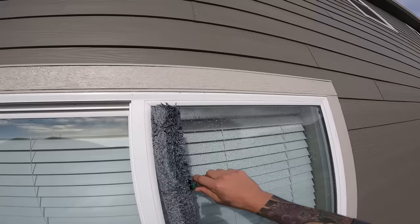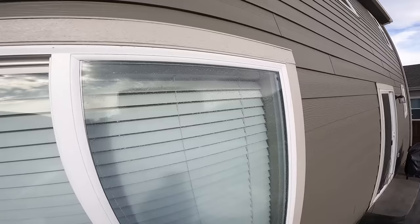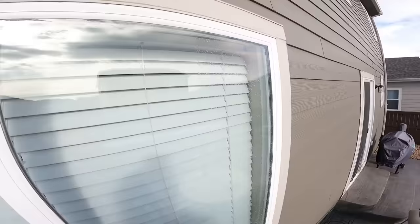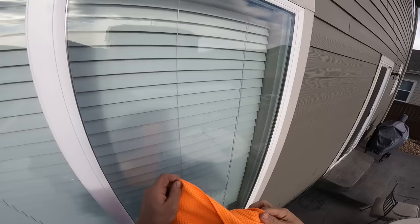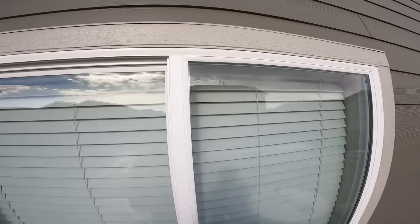To start out if you're a newbie using a squeegee, I'd use the two-pull rule. If you can do two straight pulls, that's fine. On this window you can do two pulls down with a 14-inch. When you're new this is a good rule to start with so you're productive but still doing a good job. After you do that, always take a towel, wipe the top, wipe your edges — and that's a window clean, especially with a good rubber.